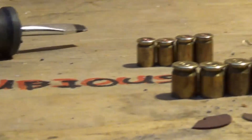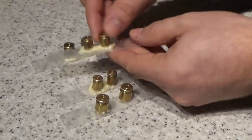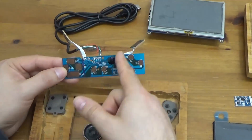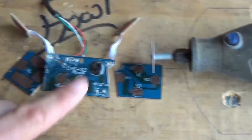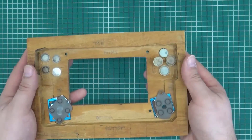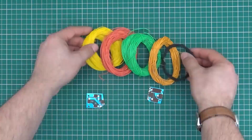There's also a little audio amplifier and a couple of speakers installed in there. Another thing you'll notice during the high speed video is that I changed out some of the buttons. Originally I went with little rubber graphite connector buttons, but they were just too compliant and really didn't work out well. So I changed everything out for micro switches, and that's made a really big difference to the gameplay, how everything feels, and the controls in general.